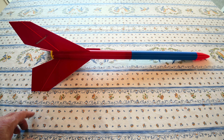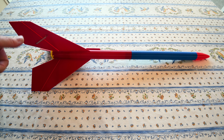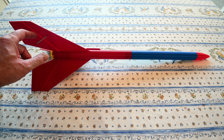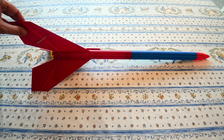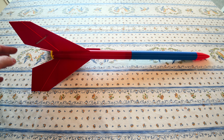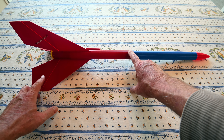The other improvements are that I moved the position of the spring somewhat to get a better angle on the ejection of the fins. The biggest improvement is that the hinges are completely 3D printed. Before, I 3D printed part of the hinge and then used a piano wire through the hinge sections that were printed on each side of the flaps. But now it's all one piece, so the rocket is only three parts — the red part here, including these flexible fins, as you'll see in a minute.